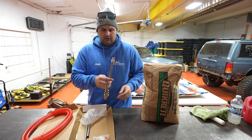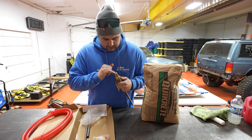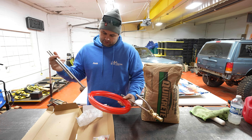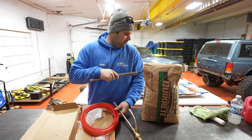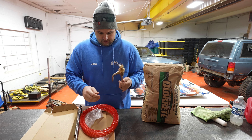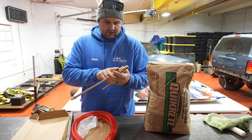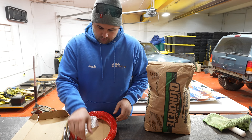So I ordered it — found it on Amazon — this is a power washing sandblaster attachment. You put this little end into the coupler on your power washing wand. There's a ceramic tip inside the brass fitting so you don't wear the brass tip down. There's a hose you attach to this and a pickup tube on the other side. You jam it into a bag of sand or a bucket. From what I understand, there's no air involved — it's just the suction created when water flows through, creating a vacuum that feeds sand in and sprays it with the water.